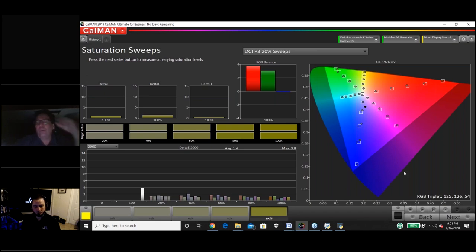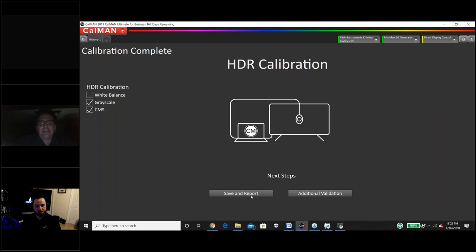But one of the things we deal with a lot is OLED product, and in OLED, in the consumer world, and even on the client monitors in post-production, they're WRGBs. So as you go past 300 nits, it has to kick in the white pixel to create the light output. As you do that, you desaturate colors. So as you increase luminance values of the colors in HDR on those panels, you're always increasing the color error. Yep, and it's very obvious on those panels too. The higher you crank up the OLED light, the more desaturated the colors start to look. Exactly. It's color volume.